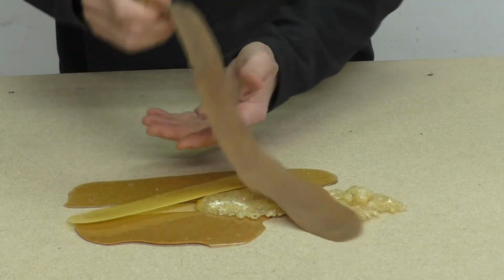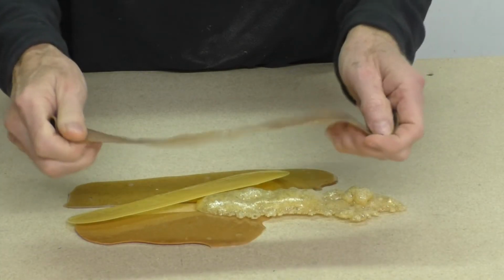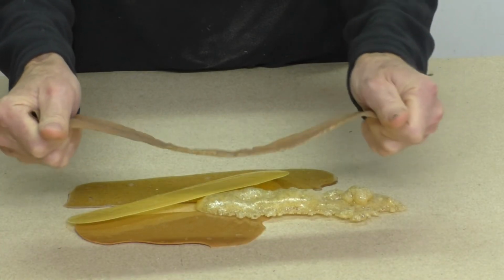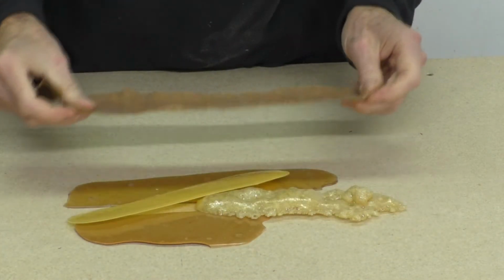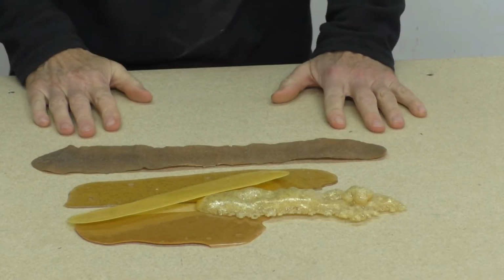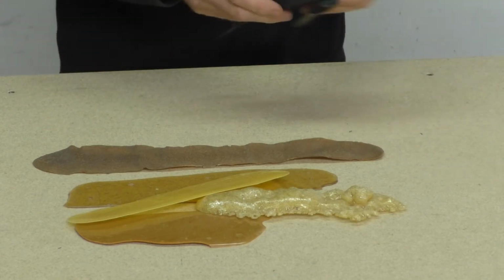Let's examine the contact cement first. Look at this glue. If hardness and rigidity is the primary quality, this glue is a total fail. It's far more flexible than the veneer it would attempt to hold. Yes, contact cement allows you to glue veneer without a press, but the bond is simply too soft. I probably sell more vacuum presses due to contact cement failure trying to press veneer and then the veneer bubbling up than any other single reason. I would never consider this glue for veneering.